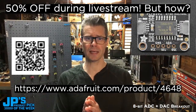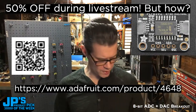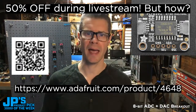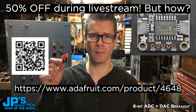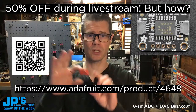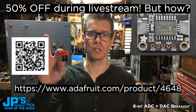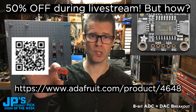One thing I think Lady Ada mentioned in her video, and I'll reiterate, you can use the little jumpers on the back of this to pick I2C addresses, and there are 4 different addresses available, which means that you can hook up to 32, I'm sorry, 8. There are 8 addresses available, so you can hook up to 8 of these. Am I right with that? I think that's right, yeah, and you can have 32 analog inputs and 8 analog outputs all on one machine.